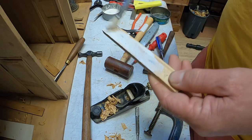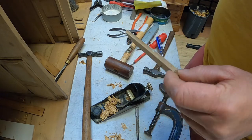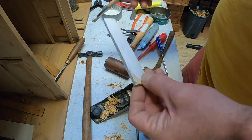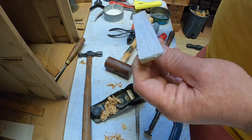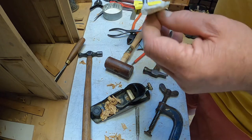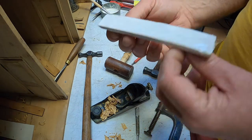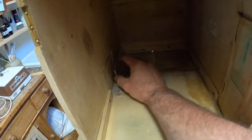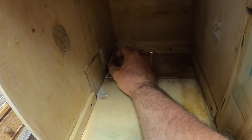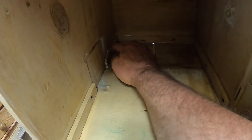It's chaos in the studio but we are gluing down skirting boards which I have planed. There are quite a few of them — five or six rooms. I'm using plenty of glue. The reason why I'm putting these back in is because they're actually part of the structural supports as well, because they support the floors. I've taken the fireplace out so that I can put them in, and as you can see they actually help brace the floor as well.